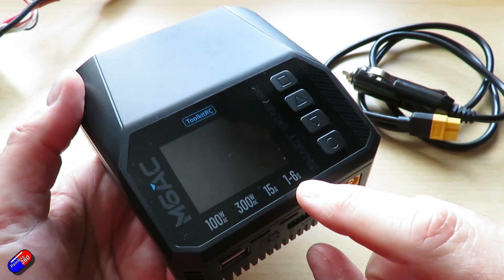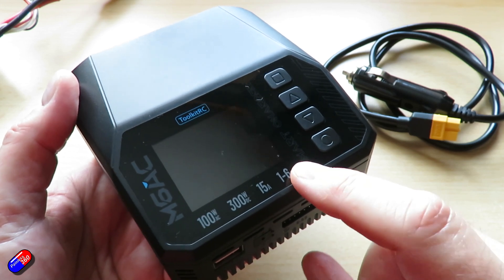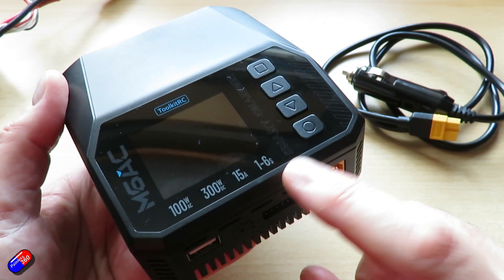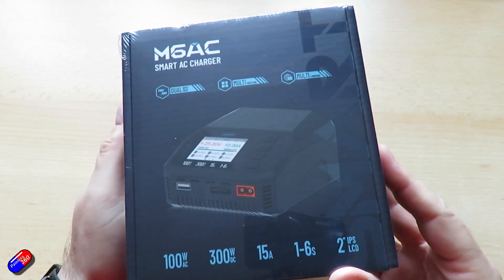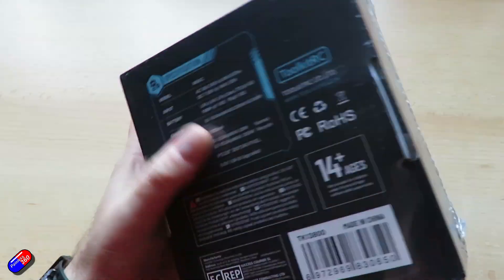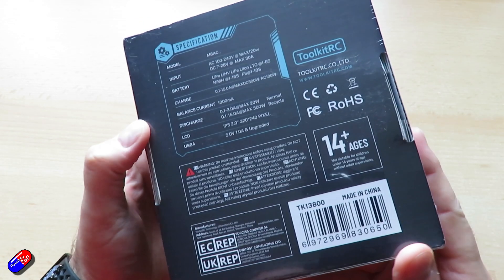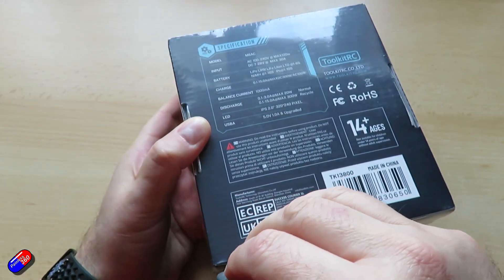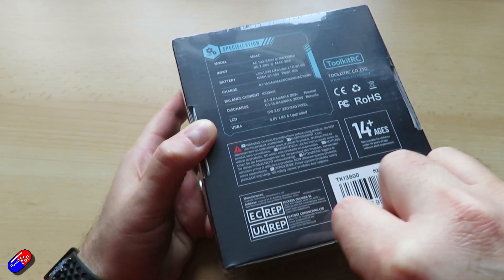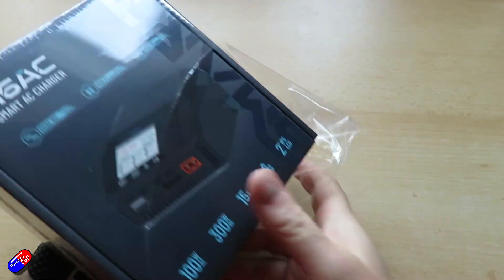This also is a bench power supply, a signal and resistance measurer, a signal generator, an ESC tester, and a DJI-style charger for things like UAVs. Input voltage is 100 to 240 volts, maximum wattage on AC is 120 watts, and on DC it'll work from 7 to 35 volts. Battery types supported are LiPo, LiHV, LiFe, lithium ion, LTO, nickel metal hydride, and some other things too.